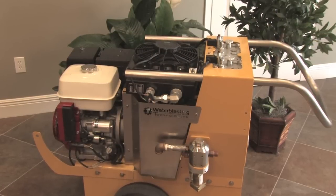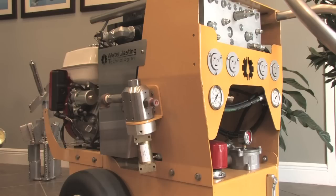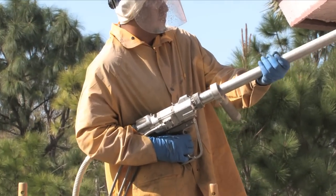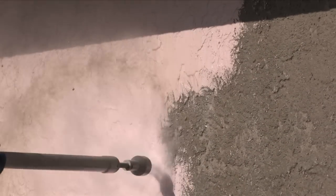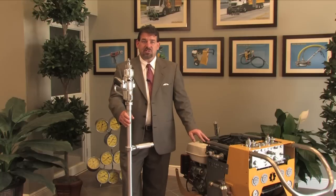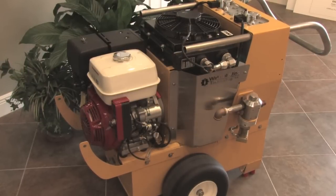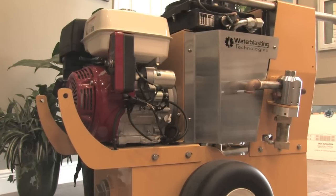The HogPak utilizes hydraulics to turn the valves on and off. Hydraulic valves last far longer and are more reliable than air-driven valves. We estimate the life of one of these Hand Hogs to be two years before you have to rebuild the hydraulic motor, compared to my personal experience of owning an air-driven gun about five weeks before having to rebuild or replace the air motor. The PowerPak uses about six gallons of fuel an entire day, as opposed to a 185 Ingersoll Rand air compressor that uses six gallons of diesel fuel an hour. Note the size of the PowerPak as well — it's small and fairly lightweight, especially when compared with a 185 or 125 CFM air compressor, and it can fit in the back of a pickup truck.